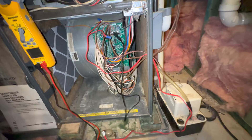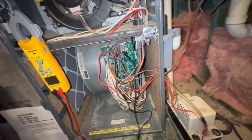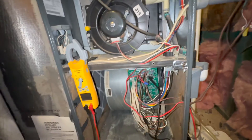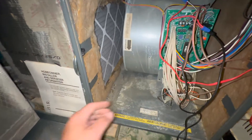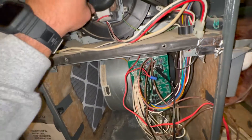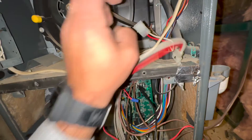Either way, that's how you'll check and make sure it's one or the other. When you know your furnace order of operation — what goes first, second, third — in this one you hear the first click, that would be the inducer. It's not coming on, so it's going to be one or the other: board or inducer. Not sending any power, so it's the board.